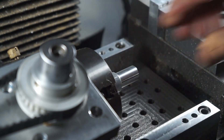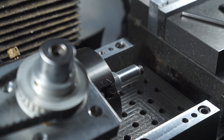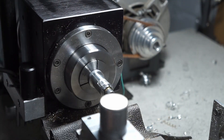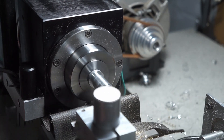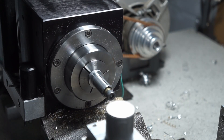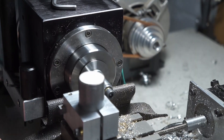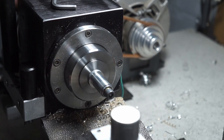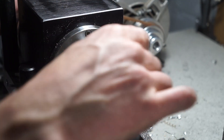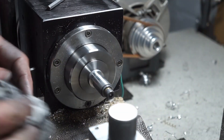I'll use a little piece of leather to pop it off once it's finished, then slide the next part on, snug it up, and that indexes pretty repeatably. Once clamped in place the mill carries on doing the engraving work, and then I'll take the finished piece over to the lathe and put it on another jig to cut the edge chamfers. Then I'll run a light polish on the outside to give it a nice uniform finish and knock off any burrs raised during engraving. The second holder has some splits in it with a little brass taper on the other end driven in by the screw, so it expands from the inside - that lets me hold the part and still have access to both ends for chamfering. Did a bunch of those and then boxed it up and sent it off.